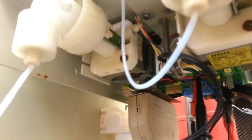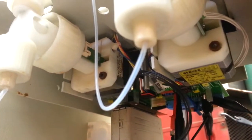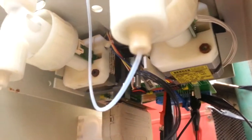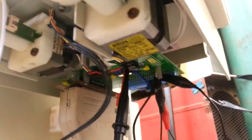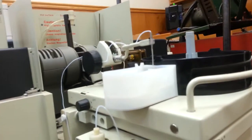so it tries to move that motor all the way to one end or the other, and what I've noticed is that if I unplug the Hall effect sensor and trigger it manually, the motor stops prematurely and starts going the other way. So clearly, what's going on here is we're not getting the signal out of that sensor, and whether that's because something is not actually engaging the Hall effect sensor, or because there's an issue with the Hall effect sensor is not immediately clear yet. But I'm going to fire up the software here real quick. And it's going to go through its usual test procedure.